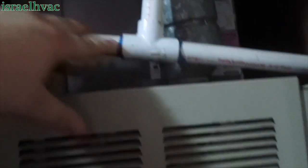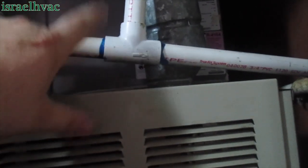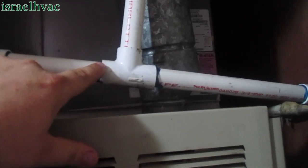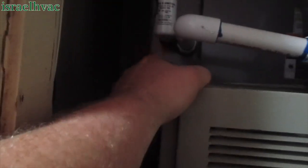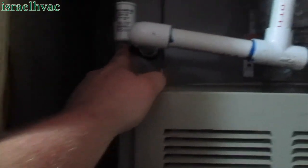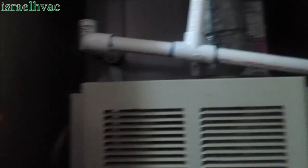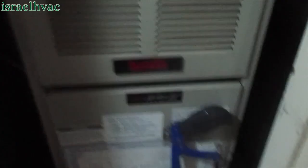You can see he's got buckets and pots under here catching the water, so I'm sure that this drain line is stopped up. What I'm going to do is cut it, blow it out or pump it out with the Mighty Pump, and replace this T with an SS1 float switch. I'll eliminate the SS2, cap off the secondary, and go with an SS1, because what's happening is it's backing up and I don't think it's getting to the SS2 quick enough.